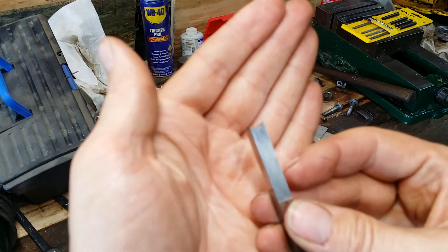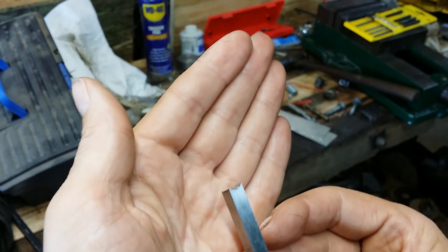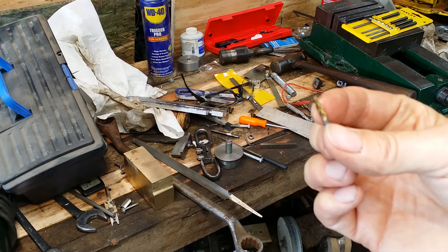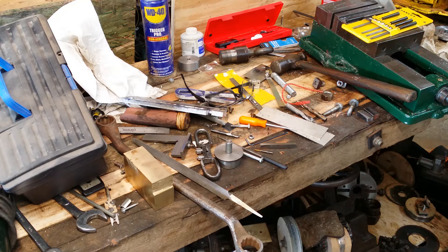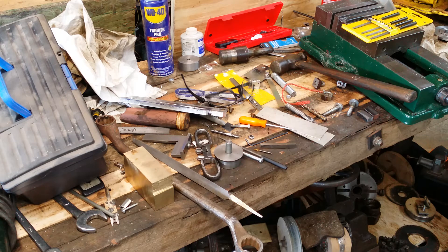One of the things I may also need to do is run the form tool on the material first, so there's less material for the little end mill to tackle. I'll take another stab at this with the steel rod and see how that goes — but it may not be tonight, because there again I think it's going to be another possible evening for hunting comets. I also need to change the positioning on the dividing head a little bit — move it either closer or farther away from center. It's going to take a little bit of figuring out, but trial and error.